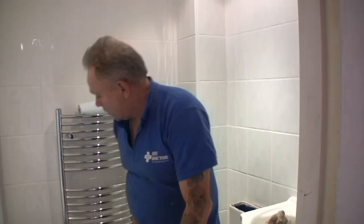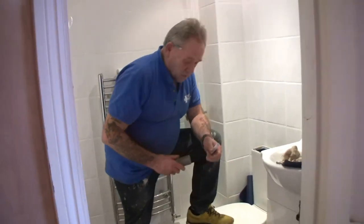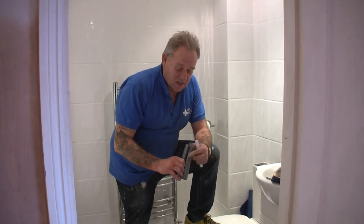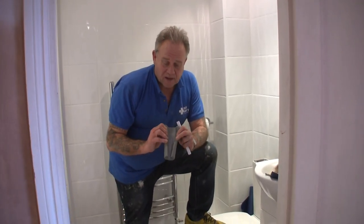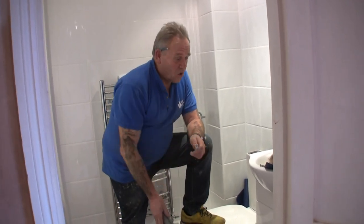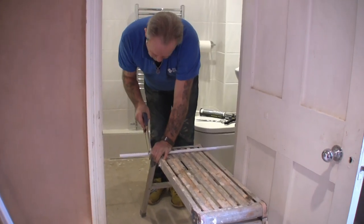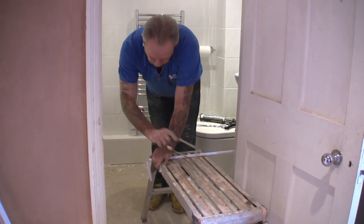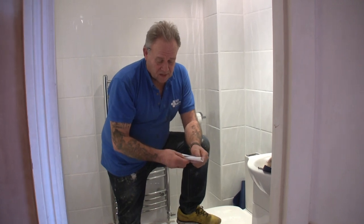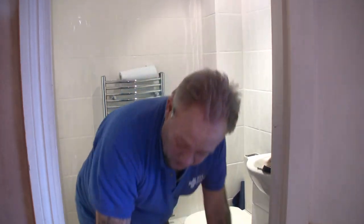To avoid condensation on the pipes, because they obviously carry cold water to the cistern and are as cold as the water in the cistern itself — if you've got room, you can put some ordinary pipe lagging on and perhaps paint that to match the colour of your bathroom. That's ordinary 15mm pipe lagging. Or you can use these little things called a pipe snap. It's a piece of plastic moulded into a curve, and if I can find a piece of copper to demonstrate — it simply clips over the copper pipe.